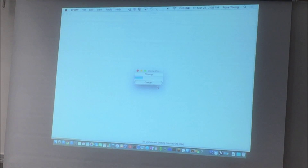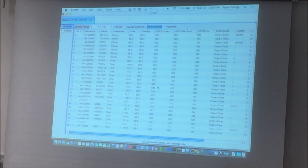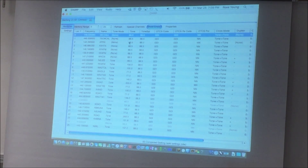I find it's kind of like my kids — the first time I have to say 'hey, are you listening?' and it has to wake up out of a sleep state. The second time it always answers and shows exactly what's on here. Here's a simple way of how I set up my call frequencies. On the first two channels, I put the call frequencies — I have the two meter call and the 70 centimeter call right under it.